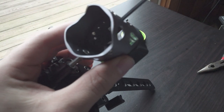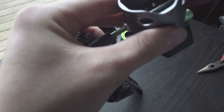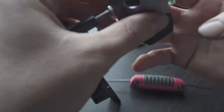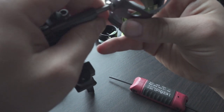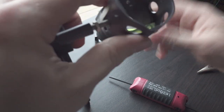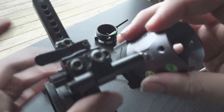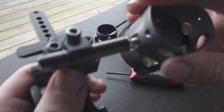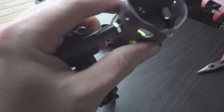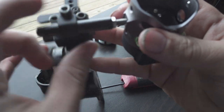I'm just coming in from this side down into here, just tightening this. The nut got tight there. You kind of want to get this nut down towards the scope here. What you don't want to do is, when you start getting it tight, use the scope housing to twist it the last little bit. I did that earlier and it kind of beveled out my scope housing a little bit.